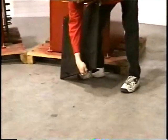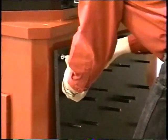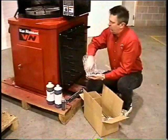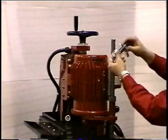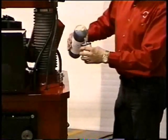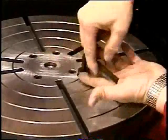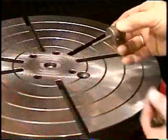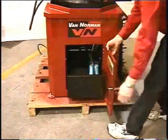Unpack the tool board and insert the two dowel pins into the back side. Next, screw the top tray onto the tool board. Finally, bolt the tool board onto the machine. Unpack the tooling provided and place it on the tool board. Install the handles onto the dresser arm and the hand wheel. Fill the oil reservoir in the rear of the FG5000 or FG10000 — this provides lubrication to the column and the table. Fill the table reservoir by removing the allen headed plug in the table. Calibrate the dipstick by adjusting the rod to be even with the bottom of the table; the oil level is full if it reads even with the groove on the dipstick. The coolant provided is a concentrate and should be mixed 50 to 1 with water.